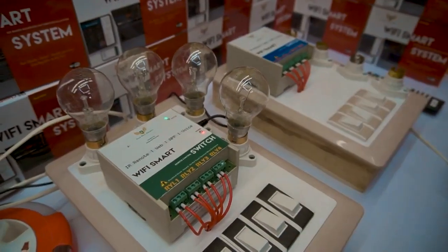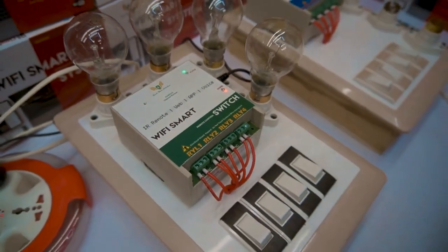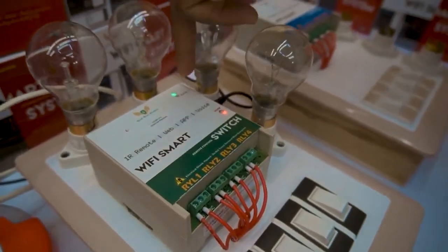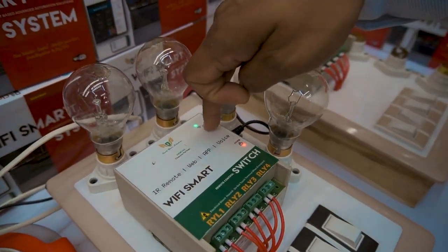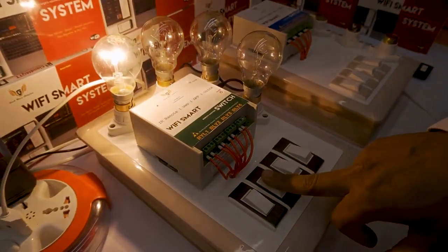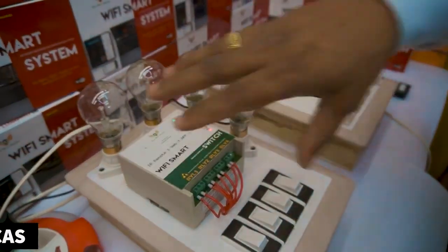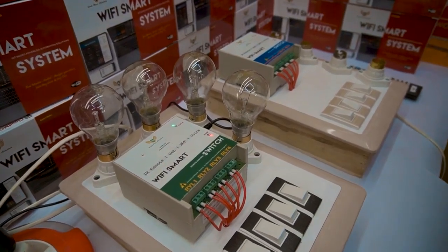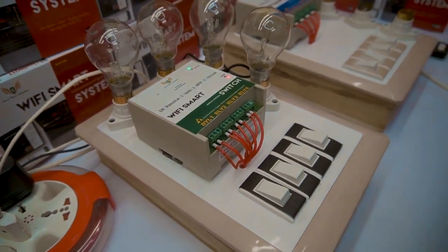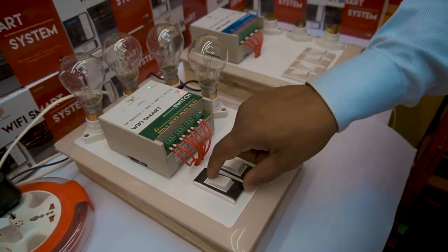This is the Wi-Fi Smart Remote Control. If you are in a rural area or in some cases where you don't need internet, you can still operate particular loads from the smartphone. We have manufactured this device for that case. It comes in green color with Wi-Fi indicators. This system comes with inbuilt Wi-Fi — when you power on, the indicators come on automatically. You can also operate this device from the existing switches and place it on the wall anywhere like a calling bell, routing through concealed pipes or surface casings. We have made a parallel connection here.